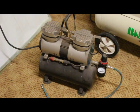So this first compressor I'm going to show you is the one that I started with. It came from eBay and it's a quarter horsepower, maximum pressure of six bar. There are two switches on it — you can either switch it up and it auto starts at three bar and stops at four bar, or you can switch it down and it's a continuous, cutting off at six bar. The air tank — the black thing at the bottom — is a 3.5 liter.